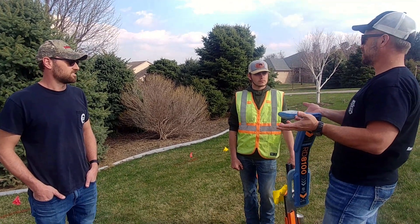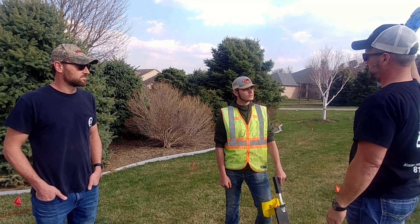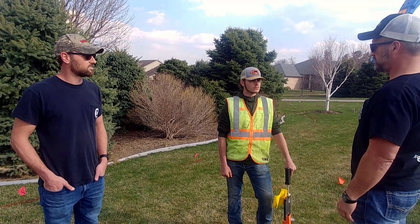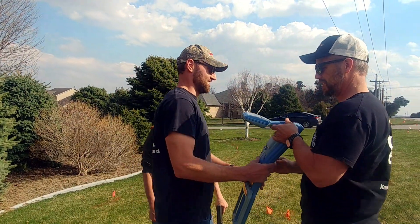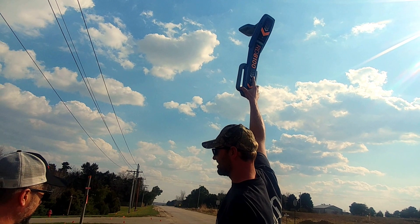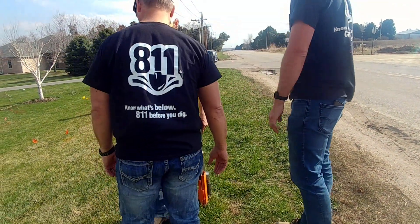High resistance requires a higher frequency. So let's see what we do here. We may have to go back to the transmitter and actually use a low frequency and ground the other end of this trace wire, but let's try this first. Am I not tall enough? You want me to give it a go? I can't see the transmitter from here. Use the tall guy? Yeah, I'd go to the top of that hill. I went to the top of the hill. Double beep means it changed. Alright, go for it.